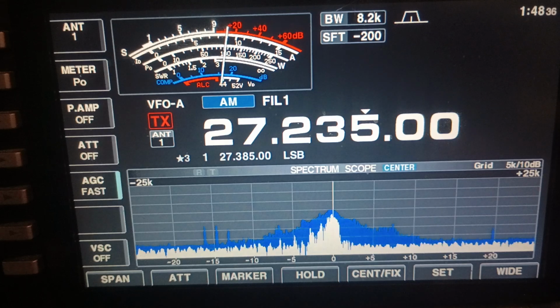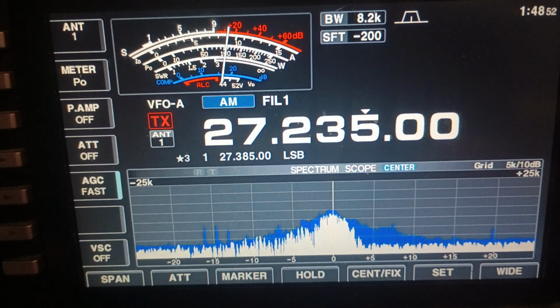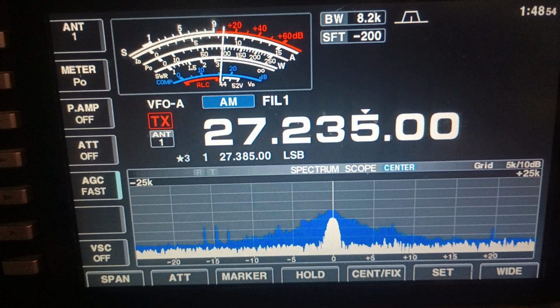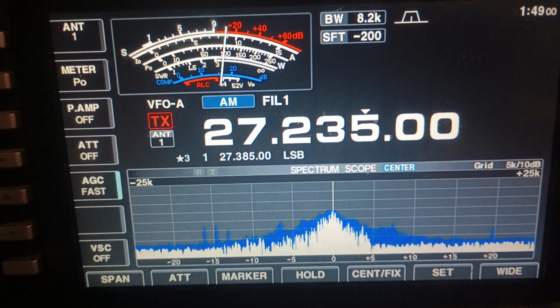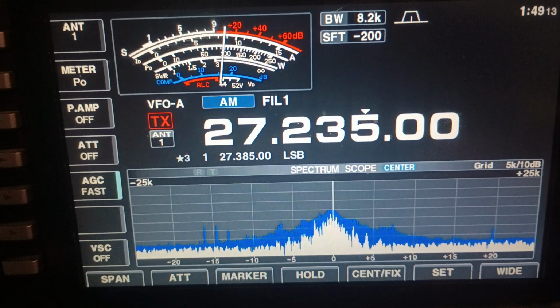Again, the mic gain is about 2 o'clock right now. We can turn it back to 12 o'clock, and it seems like our audio drops off quite a bit. Remember, this is a noise-canceling mic. Or we can turn it wide open right there. Audio, and we're starting to get a little bit of a ring through the Cobra 90 that's in here with me. But that's wide open on the mic gain. That's about 3 o'clock on the mic gain. And that's about 2 o'clock on the mic gain. And that's on the Uniden PC68 LTX, the little kind of square compact Uniden radio.